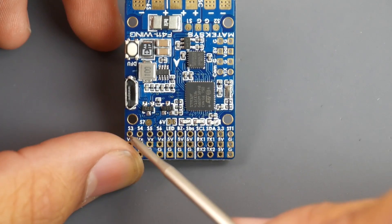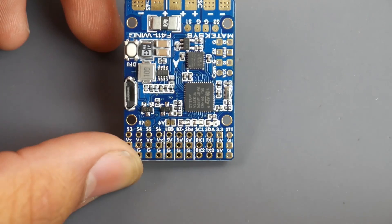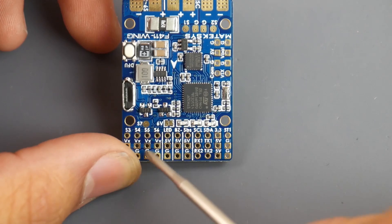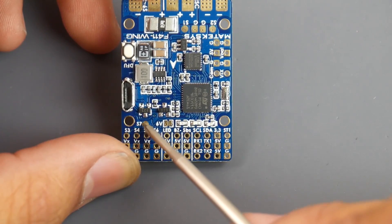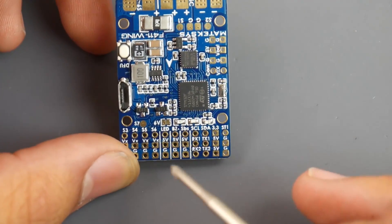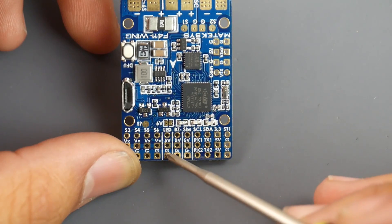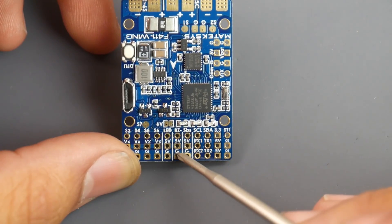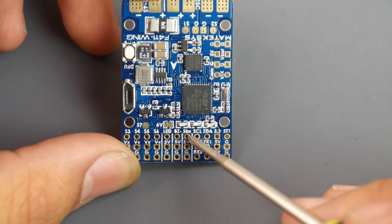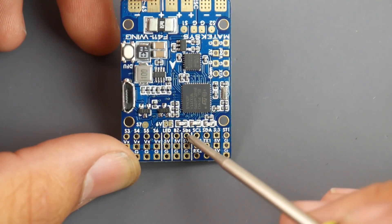For my little wing I'm keeping it at 5 volts. The servo signal outputs are S3, S4, S5, S6, and S7. To use S7 as the fifth servo you'd need to bridge one of the servo power pads to supply it. They also provide an LED output — LED signal, 5V, and ground — and a buzzer pad. S.Bus is on UART2 as an inverted S.Bus signal, so you'd connect your FrSky S.Bus or any S.Bus receiver there along with 5V and ground.